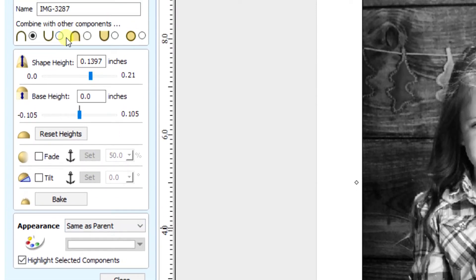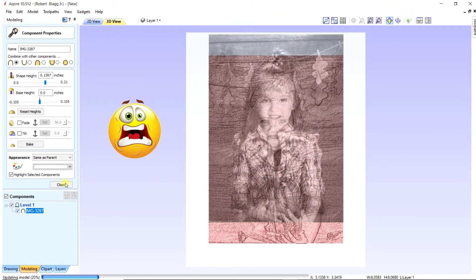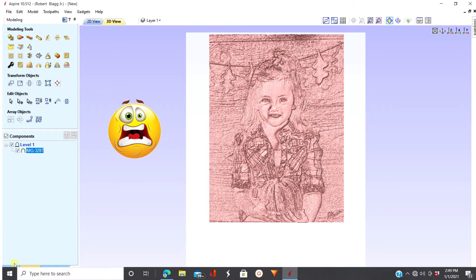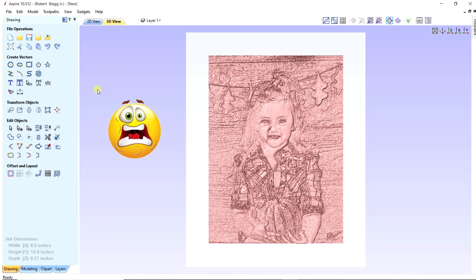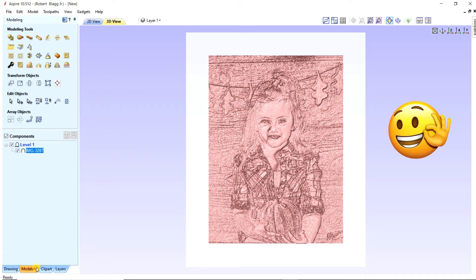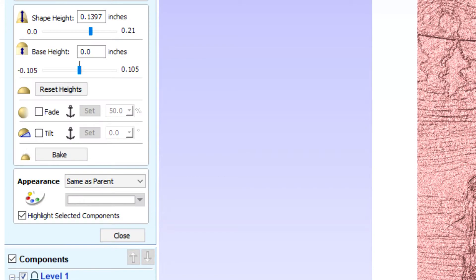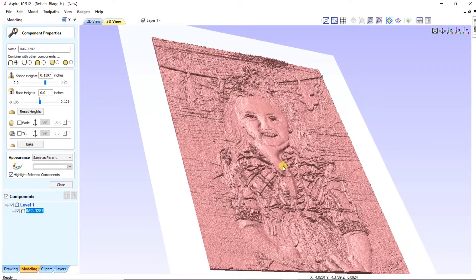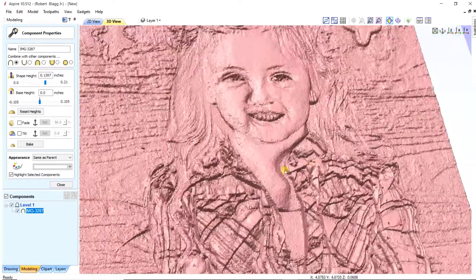To make this work properly, there are a couple of things you need to do. First, you need to reverse your image to where it looks like the eyes are sticking out — you'll see here in a second. The next thing is the shape height of the actual model. Those two things are crucial. And then on the machining side, you need to have 0.04 underneath the model. Those three things are very important for this to work.